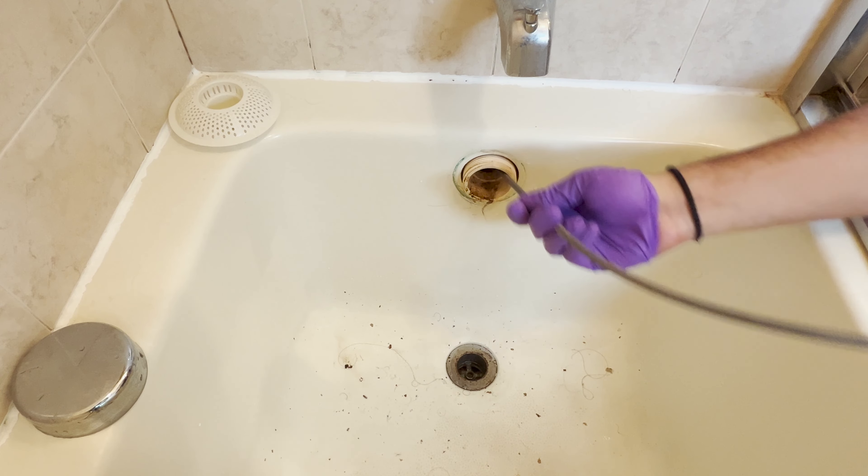Turn for another 15 to 30 seconds once you're there, then pull the cable out — and that's what it looks like. It's pretty gross. You may want to wear glasses just in case it splashes on you, and wear gloves. Make sure you have a knife or something because the hair is hard to remove from the coil. And that's it — this will unclog your drain. Hopefully you found this video useful, and I'll see you in the next one. Thank you so much for watching.